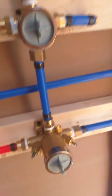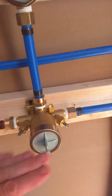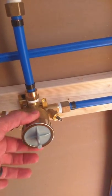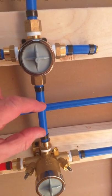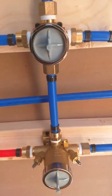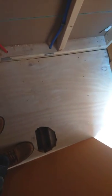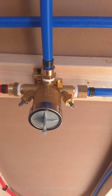One trick: they recommend centering the valve at 48 inches in the shower, but I drop this a little lower. Then take your trim piece — or if you don't have a trim, get the specs — and make sure the distance between this valve and the diverter valve is good, so the trim pieces aren't right on top of each other. You want a bit of space; it looks more presentable and doesn't look congested. To line this up, look at where your shower drain is — I've already measured that. By the way, we're doing a walk-in shower with no curb — it looks much more professional, a little more work but it looks great.